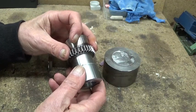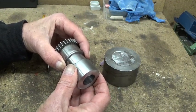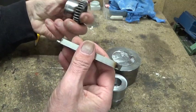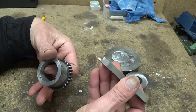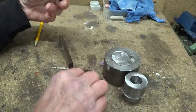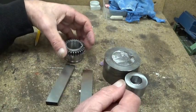I'll work the outside after when I don't need the fixture anymore. I will make the two sleeves — one goes in this side, and the other I will cut in two to go in this side. To cut on the shaper I thought maybe do it in two passes, because for my little machine this is going to be a big cut. The tool I used last time, if I regrind it I can go to the bottom but it won't make the perfect V-shape. Then I'll grind a new tool with the perfect form of these teeth and make the finishing cut — so this one I'm probably doing in two cuts.